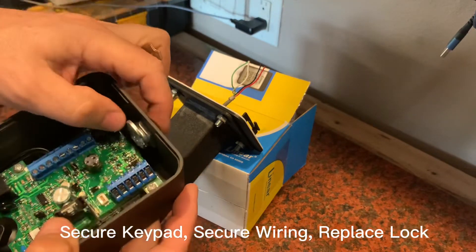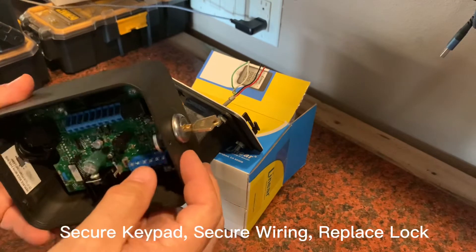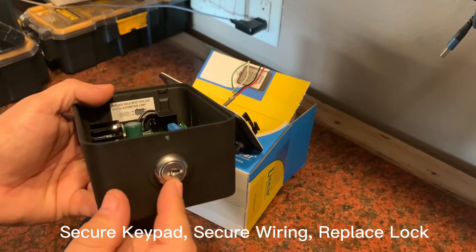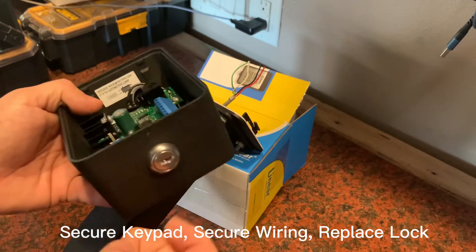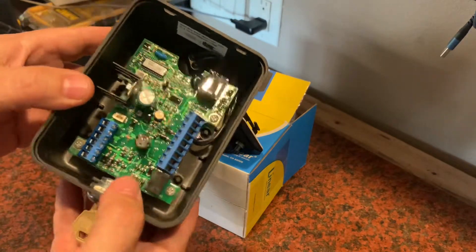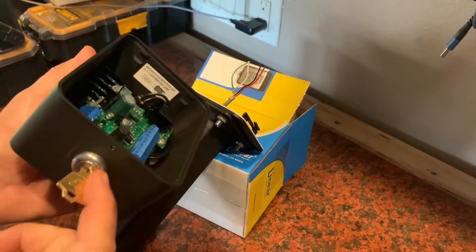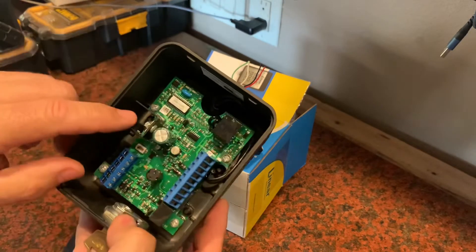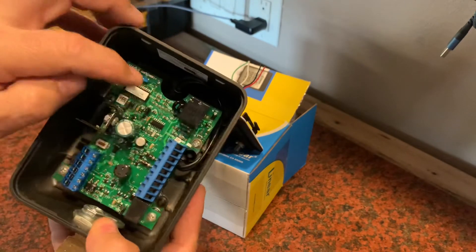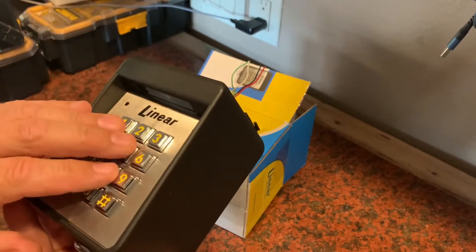Replace this whole locking mechanism. There's just a simple bolt in the back that you can loosen up, take it out, and put a different keying system on here that you feel is more secure — because as I showed you, you can easily pick this lock with just a bobby pin and a screwdriver. You also want to make sure that you're aware if your device has been tampered with. If these have been cut with a grinder or the lock's been mangled somehow, you'll get a heads up that maybe someone went in there and pulled jumper number two, reset your master code, and added a new code of their own to your keypad.